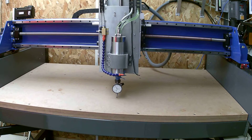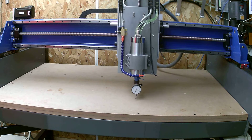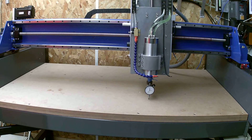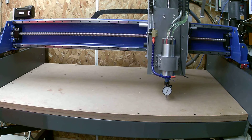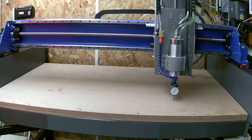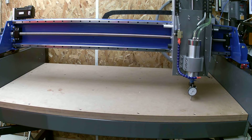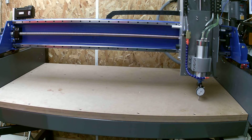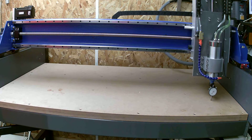The machine's not too bad, considering when I built it I just put it together using a 1200mm builder's level. I leveled the Y-axis on both sides, then leveled the gantry to suit. The parallel Y sections are all machined parallel and the table is bolted on underneath, so it should be fairly close.